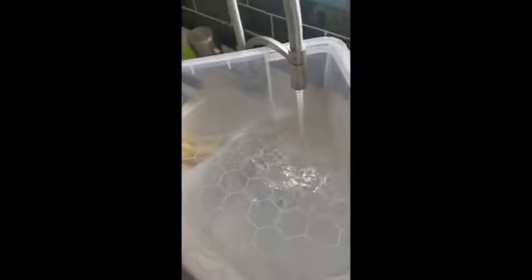We're going to fill the container. For hydrographic film, the water needs to be between 75 and 90 degrees — I used a baby thermometer to get it to 85 last time. I found that half a container of hot and half cold tap water gets you there. A tip: these big containers get very heavy when full, so I do the hot half first, carry it out, then fill it up from a bucket with cold water.